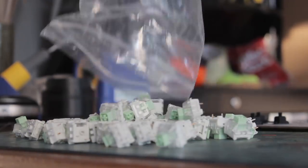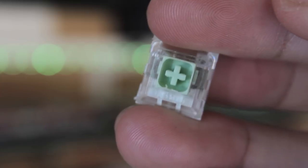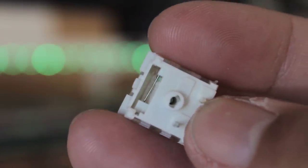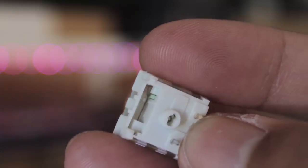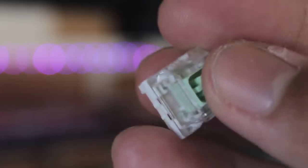The Kailh Box switches have really given us a fresh wave of switches, especially these clickies. Due to their click bar design, they have a very sharp and distinct click sound to them. Normally a clicky switch, such as the Cherry MX Blues, will have a click jacket which creates that sound. And often this results in a slightly rattly switch. With this, it's just that metal click bar that creates that click, meaning that we also get 2 clicks per keystroke instead of 1. Jades are basically a heavier version of the Kailh Box Whites that perhaps is more well known, although they have the same spring, but this just has a thicker bar which increases the tactility and makes for a lower pitched but louder click than the Whites.